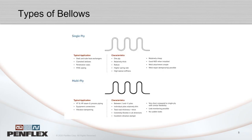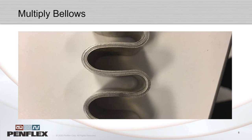The bellows can be made from single-ply up to five-ply. For five-ply, we can do 0.012 inches per ply, for a total thickness of 0.060, which is the limit of our tooling. The biggest advantage of multi-ply is that every layer can move independently, so you get the overall thickness to handle high pressure while the individual thin plies allow much easier movement. If there's high movement or vibration, a multi-ply bellows is the right choice.